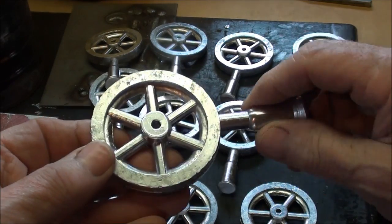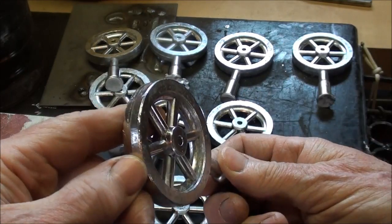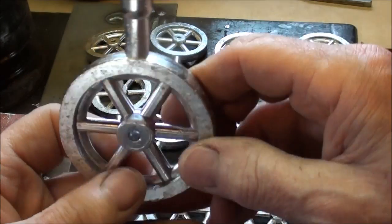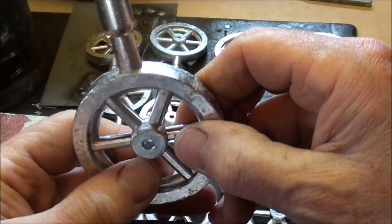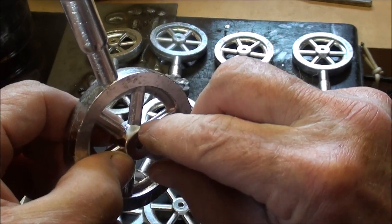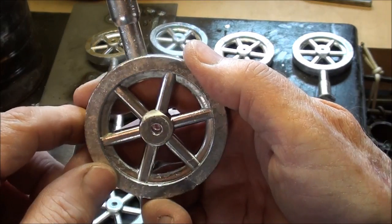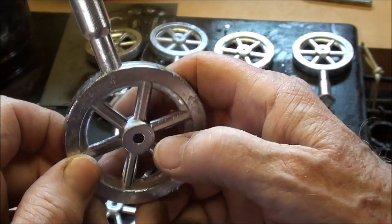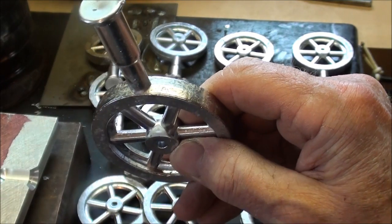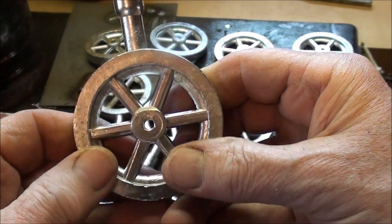Are these delicate? Yes. If I put it in a three-jaw chuck, could I crush it? Yes. But I don't intend to. One thing that I've consistently had a problem with is there's always a little sink hole right here. It will always be on the top because of gravity. That isn't really a bother to me — that's the point, it's kind of a flat spot, at which I drill and tap my set screw.